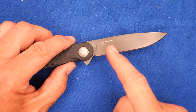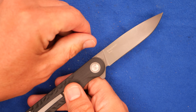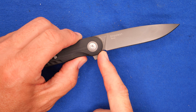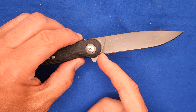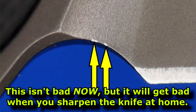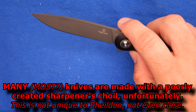A little bit more about the blade: we've got a back-swept plunge, and it's a fairly distinct plunge. You can see the starting line at the full thickness of the ricasso, and then the line where the bevel begins. It just barely has a big enough sharpener's choil — sharpen this thing two or three times and you're going to be sharpening up into the plunge, which is going to leave marks. On this side you can just barely see one spot where, when they sharpened it at the factory, they touched the plunge. That's why sharpener's choils need to be bigger than the plunge.